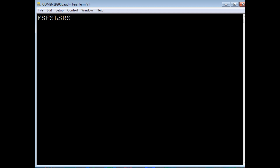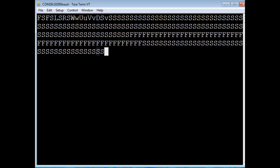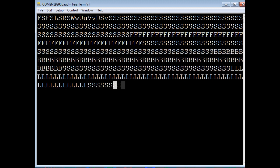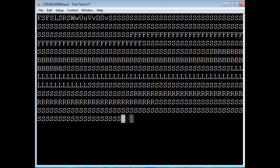For the on/off controls: headlight on sends capital W, headlight off sends lowercase w. Taillight has its own on/off code, and horn has on and off codes as well. There's also a streaming option — enabling streaming in settings causes the app to continuously stream character codes. In streaming mode: stop, forward, stop, back, stop, left, stop, right, stop — it just makes things a little more reliable.